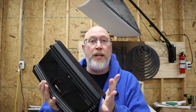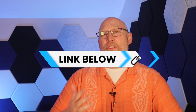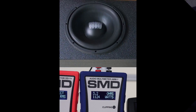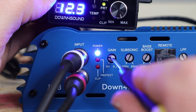When I tested this 2 ohm stable Kenwood, the same thing happened. The amp completely crushed the 4 ohm test and then fell short on the 2 ohm test. Funny enough though, when I hooked it up to a subwoofer instead of a resistor bank, the amp did make its power. It's just easier to drive a speaker than it is to drive a resistor.